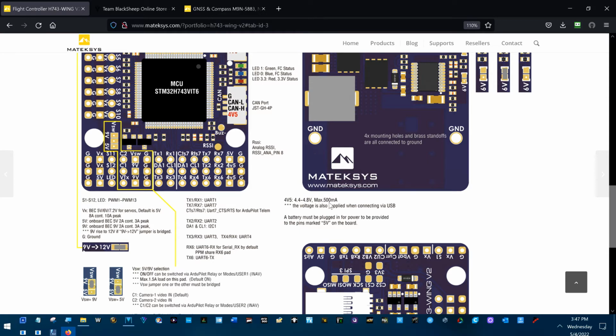So in this perfect world we're talking about, if I put my Crossfire RX Pro and it's on its highest possible output power for telemetry, it's already at this 500 and it's running along young, dumb, and happy. No problems. Probably a little warm, like most young are, but happy. But if I connect the GPS module to this 4V5 voltage, boom, I'm at 550 milliamps draw, and I just blew up this board.